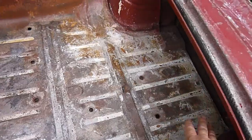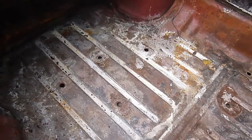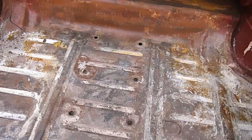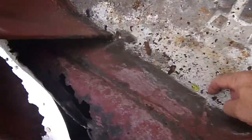So what I'm going to do next is vacuum it all out, go back in with a wire wheel on a drill bit, and wire brush all that out — and my grinder if I need to — just to knock off any loose rust.